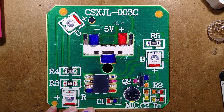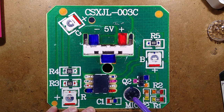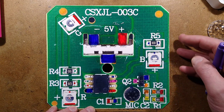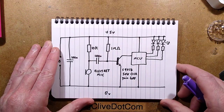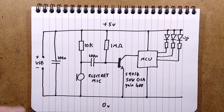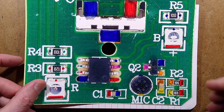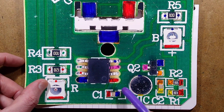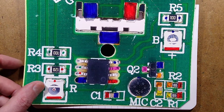We've got three LEDs common to the positive rail and each LED has its own resistor. The green and blue LEDs have a 10 ohm resistor; the red LED has a 12 ohm resistor because it has a slightly lower voltage. There's a decoupling capacitor here. Looking at the schematic — the decoupling capacitor could have been placed directly across the microcontroller, but instead it's placed here. I wonder if that's an attempt to make the audio circuitry more stable — it didn't work.